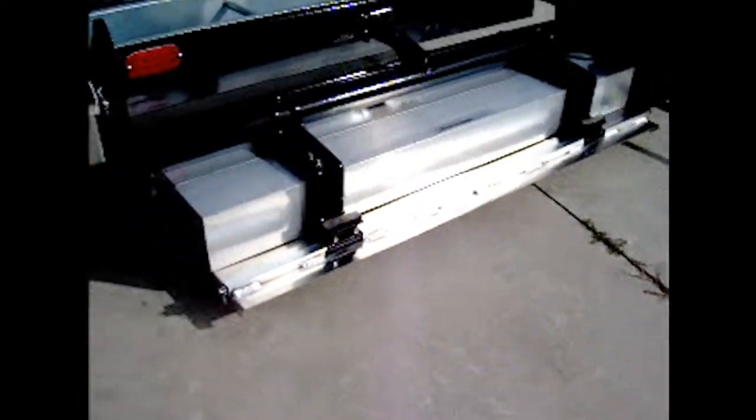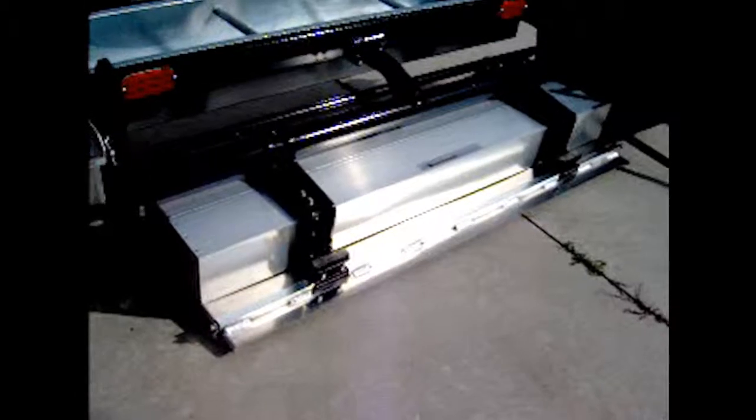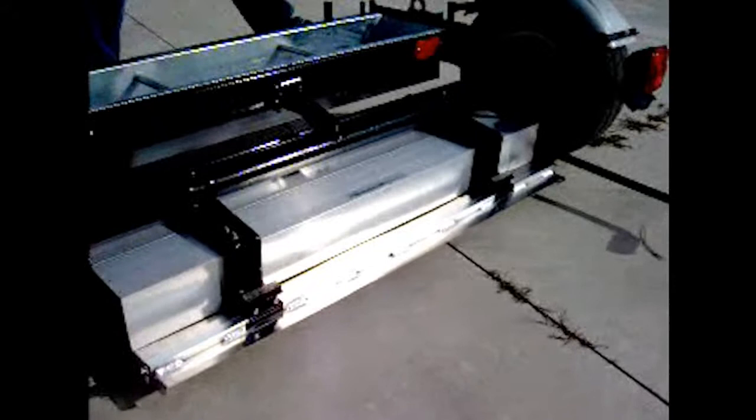You can see how the back of the sweeper is a little bit low right now. I'm going to go around to the front and move the tongue up and down so you can see how much it affects whether the back of the sweeper is level or not. You can see that if it's too high, your sweeper is going to be dragging on the ground. So you want to make sure you've got your tongue level.